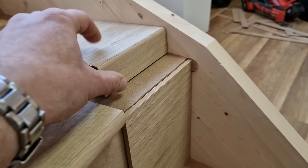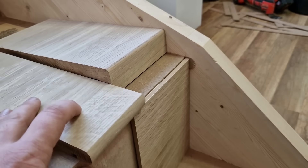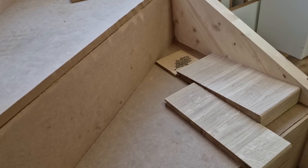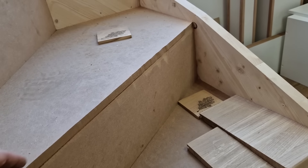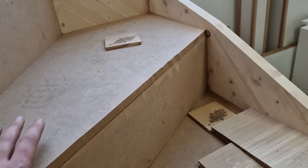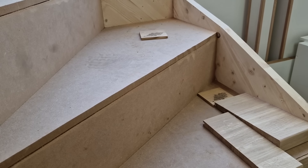The only difference in the riser is, if you were going to use the classic range, the riser would have to be cut 2-3mm higher to allow that space to actually go in into that groove. A very important part of this process is to make sure that by cutting the nosing out, you do not weaken the strength of the staircase, so it still remains rigid. You need to assess whether by cutting and removing that nosing, the staircase is still rigid and sound.